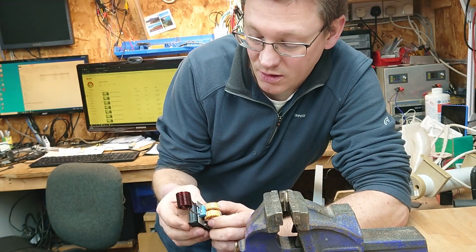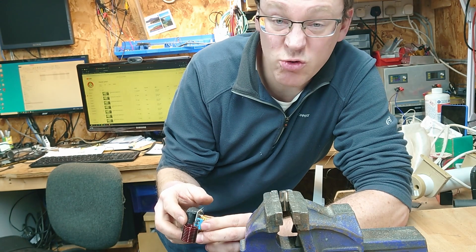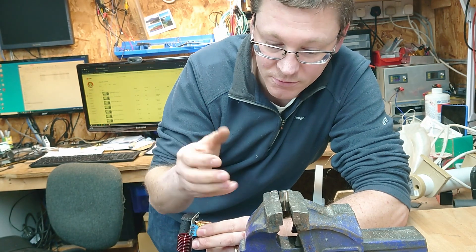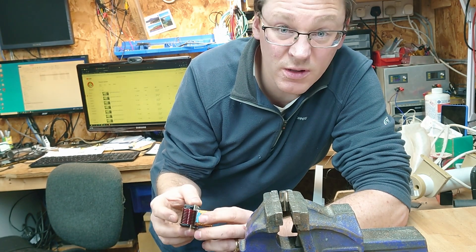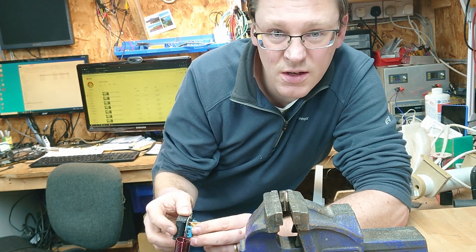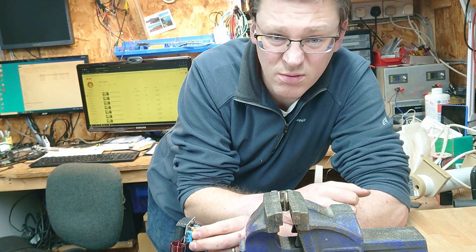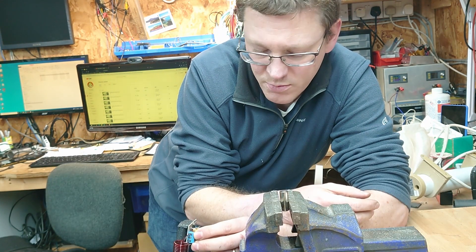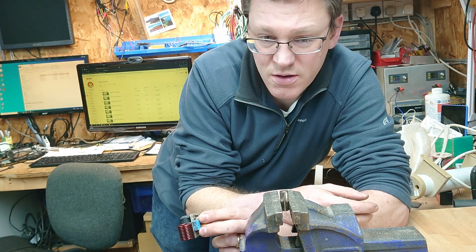Well, that was just a little experiment on my part to see if that would work, and it does. It needs a bit more control because this thing just keeps heating without any sort of feedback at the moment, so I need to be able to turn it on and off to regulate the temperature. That's a little project to go on the list for the future — make a little induction heater solder pot. It liquefies in about 10 seconds or so, it's quite impressively fast, it just needs a little bit of refinement. Pleased with that little experiment. Thanks for watching, see you next time.